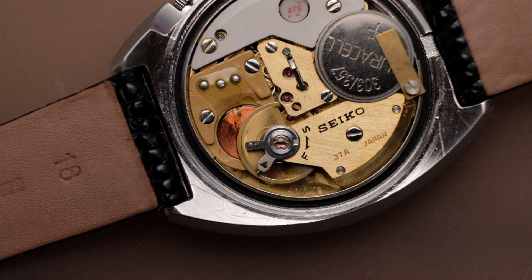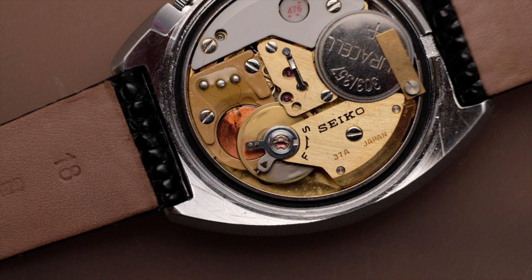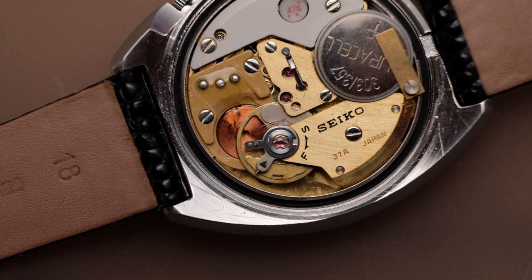So what I did was record some slow motion video of the balance in operation to capture the two turning points where the balance is at each extreme of its oscillation. As the balance rotates anti-clockwise it will go through a full 360 degree rotation and end its rotation at the anti-clockwise turning point, at which point the magnets attached to the balance are positioned at about 12 o'clock in the view that we have. Then it changes direction and reaches its other turning point, undergoing a clockwise rotation with the balance at about 6 o'clock.